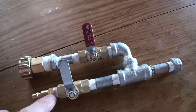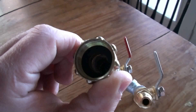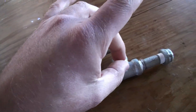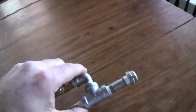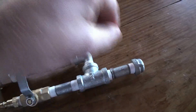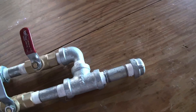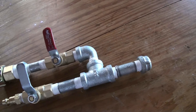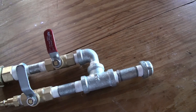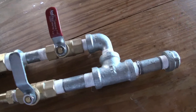What it does is it makes compressed air — that's this line here — and then it mixes standard tap water using a standard hose fitting. The two come into here, get mixed, and then flow out the nozzle at high pressure. Both are compressed up; I've run it at about 25 to 40 PSI. When they come out of the nozzle into cold air, the pressure drops quickly to atmospheric pressure, which releases a ton of energy, atomizes the water molecules, and then freezes them — and it falls as snow.